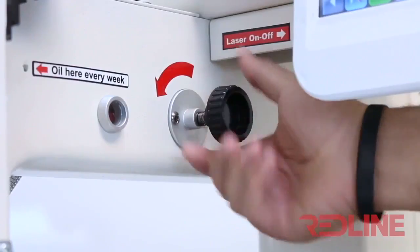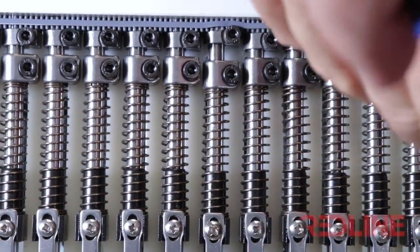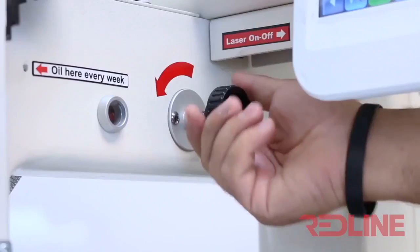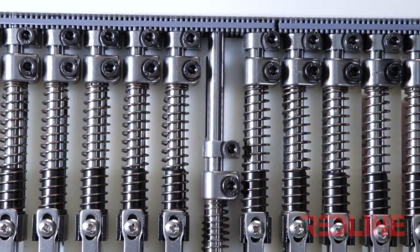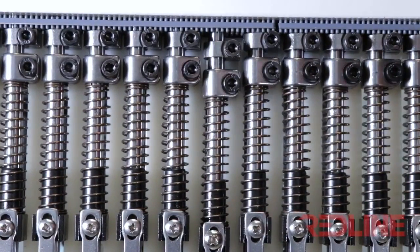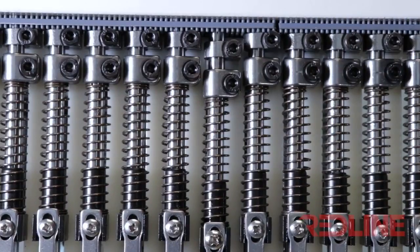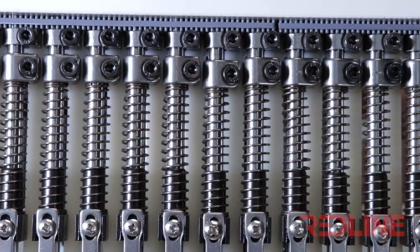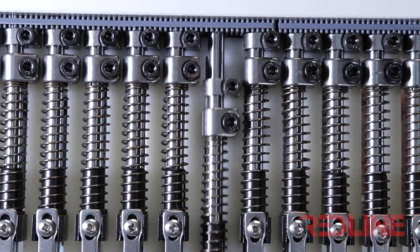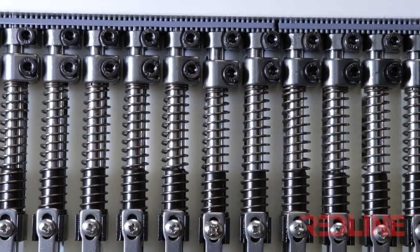If on the upper ring you observe pressure, you must readjust the upper ring. To readjust it, barely loosen the screw of the upper ring. Once loosened, do a full round on the main shaft to release the pressure. Once you confirm there is no pressure on the upper ring, tighten the screw. Then press the 100 degree icon in your control panel, and load the needle manually to confirm the needle is coming down. If the needle is coming down, you have finished the adjustment. Press the 100 degree icon, reinstall the covers, and your machine is ready.